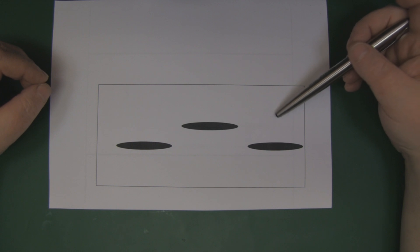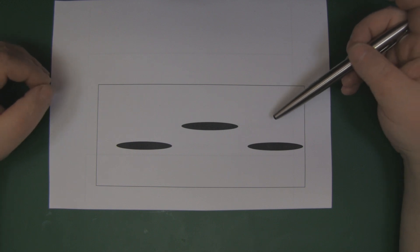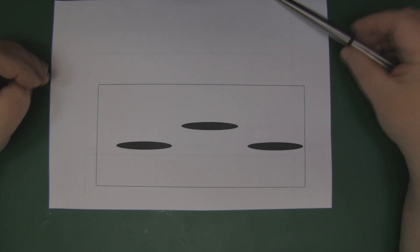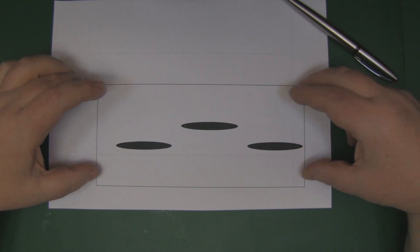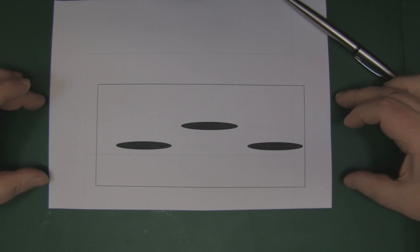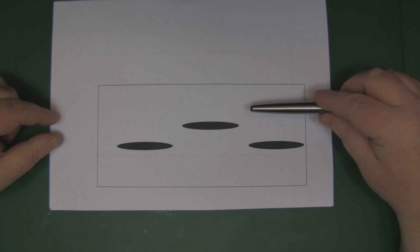This particular antenna — the slotted waveguide — has a lot of range to it. It works well over a long distance because of the waveguide element. The trouble with a normal waveguide antenna, like a cantenna, is that it has a very narrow beam width, so you have to point it directly where you want to pick up or send the signal. But a slotted waveguide antenna, depending on how long you make it, can overcome that narrow beam width because you can extend it out, and by extending it you actually increase the beam width. I think the slotted waveguide has a lot of potential, especially for FPV at 5.8 GHz.